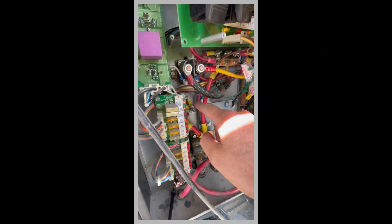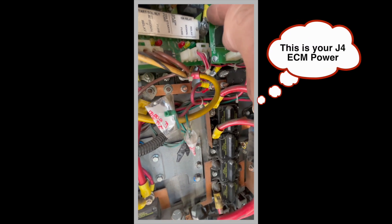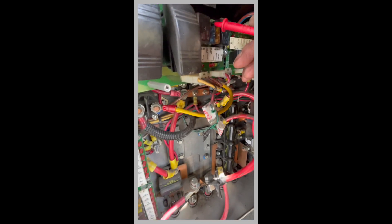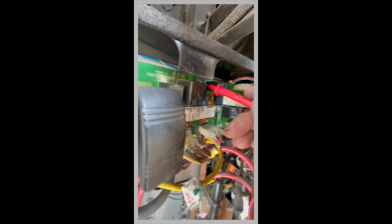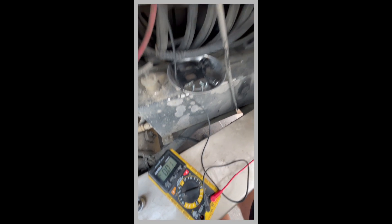J4 is the one that this feeds. When this kicks off, it has full power — J4 power — but this one back here does not have power. So right now it's kicked off and there's no power there. But J3 does have power. So it's losing power somewhere between the power lug. And here there's no power. If I wiggle this and get it to come back on, now we have power there.